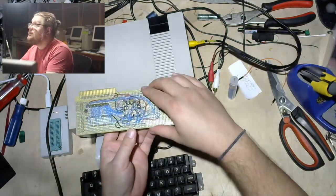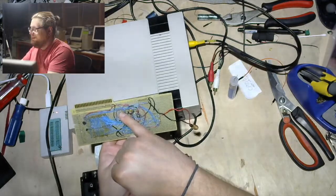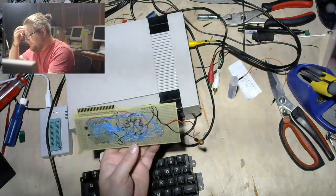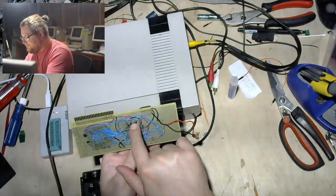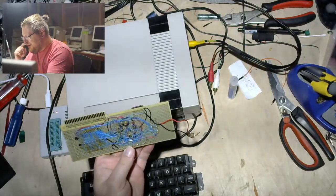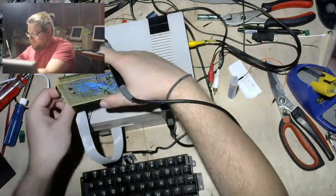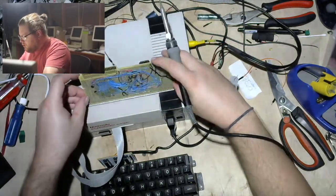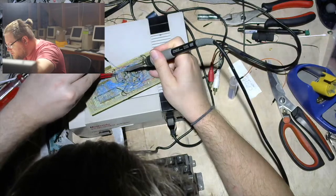So the annoying thing here is, if you can kind of see, I have power going from what I believe is an actual power pin, jumping to the ident pin, and then going over to another power pin. Oh god, no. That actually goes under this little capacitor that I put in here at some point. We're just going to have to do some rerouting here. I will unsolder those two power connections and deal with what I have after that point. It doesn't matter because I probably won't even know till tomorrow if it worked, because I'm not planning on reading any floppy registers tonight.